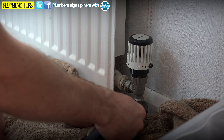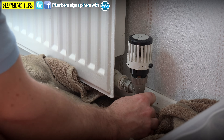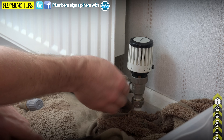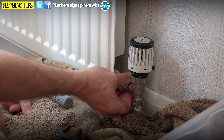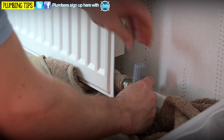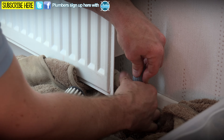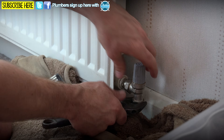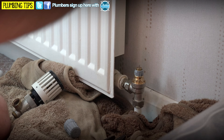We've got a vacuum on it now — we're recording in real time. There's a little bit of water coming out the bottom there. Sometimes you have to get a bit brutal with these — it's not finesse, this particular one. And as you can see there, there's no real time to pop PTFE on there; with any luck, these should seal up nicely. So now we've done that, we're going to pop back upstairs, remove our bungs, and vent this radiator out and reinstate the heating system.